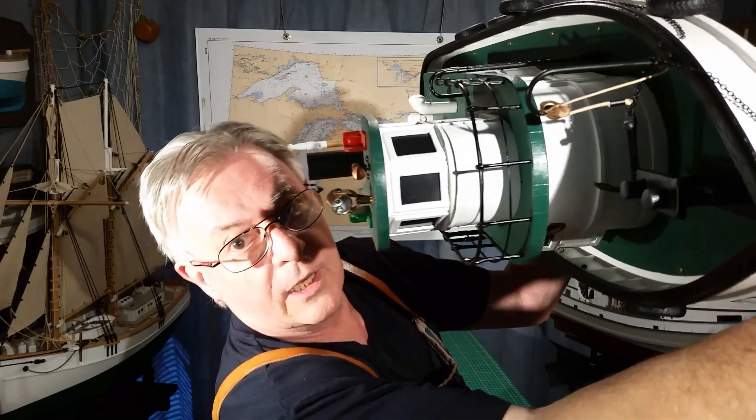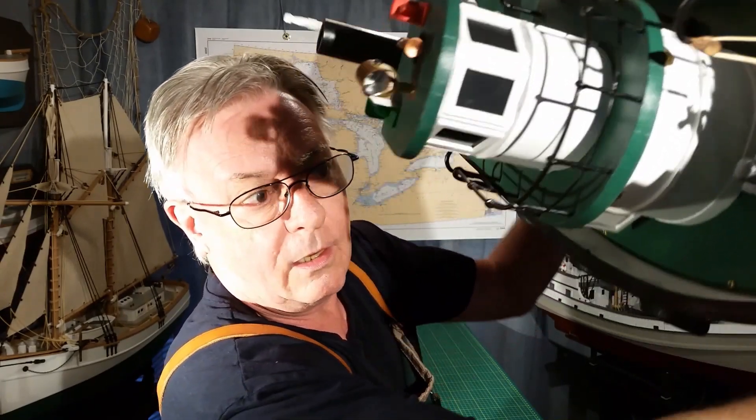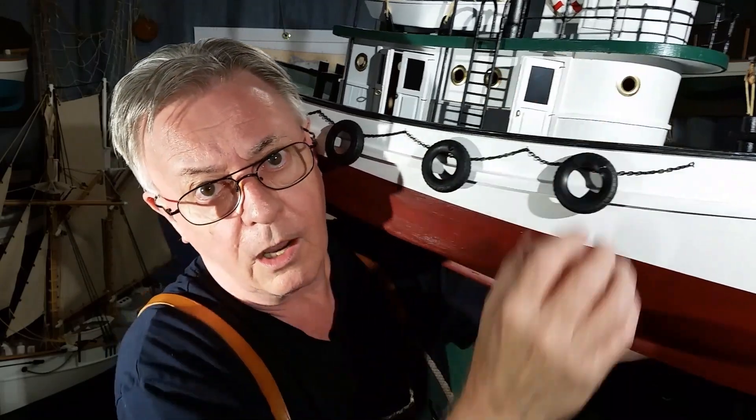This tugboat is very stable, but it has its limitations. If the tugboat was heeled over in heavy surf and water found its way onto the deck area, the boat may right itself — but it may only do it once, because once the water is in the deck area it has no way out. This boat has no scuppers. Scuppers are cutouts along the bulwark that allow the water to drain off the deck. It has to drain somehow, and scuppers are the way to do it.